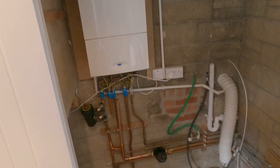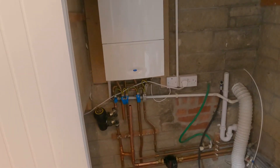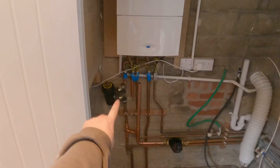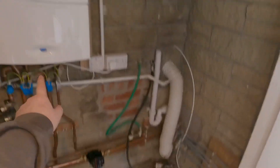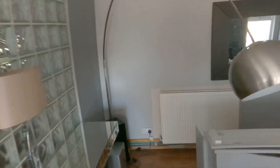We're relatively set up here. I need to grab a couple of 45s - I dropped my bender and broke the wheel, so I need two 45s for this and then a 22mm ring to tie that in and straighten this up, tying the pump back into the boiler. I've lifted this radiator - 61 kilos, absolutely brutal. I'm going to swap this one and then use my wet vac to suck everything away and drain this side down.